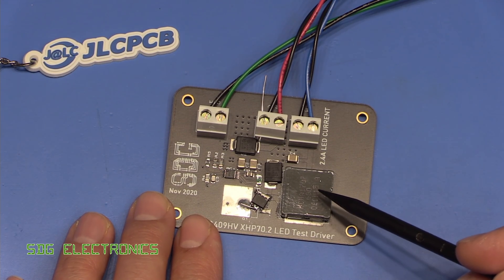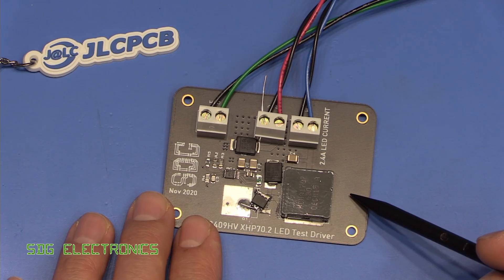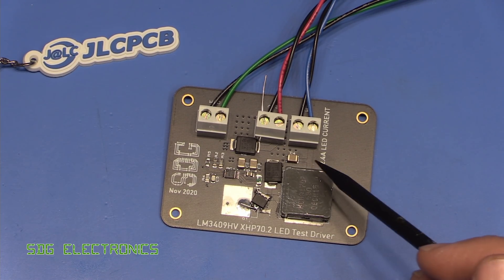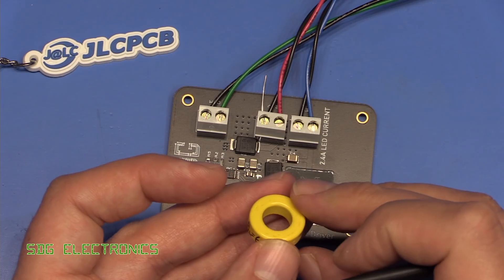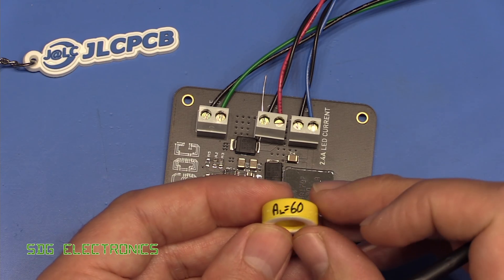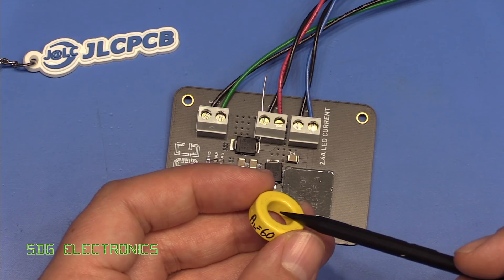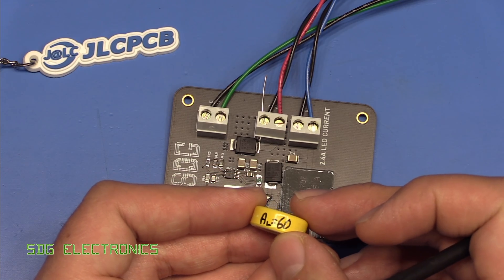The first point is around the construction of the inductor, and also whether the inductor itself is transferring sound to the PCB because it is in contact — it may be making the sound from the inductor much louder than it actually would normally be. So one thing we're going to try today is winding a 100 microhenry inductor on this core. I think we're going to need about 40 turns. We'll be isolating the sound from the PCB to see if that changes anything. Also if it's still noisy we can try potting this in epoxy or dipping it into wax to see what effect that has.